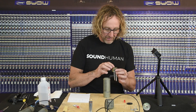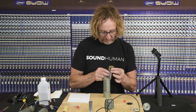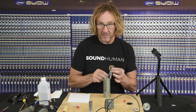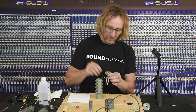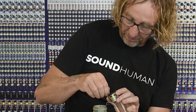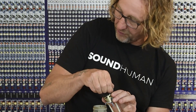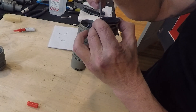That looks great. We have a phase plug that no longer moves. We can push on it and see that it's adhesed into place. Now we get to the fun part of putting this thing back together. The first thing we want to do is get this protective grill onto the diaphragm, because we can't set the thing down on its face until we've done so. I'm going to tighten up these two little screws here.